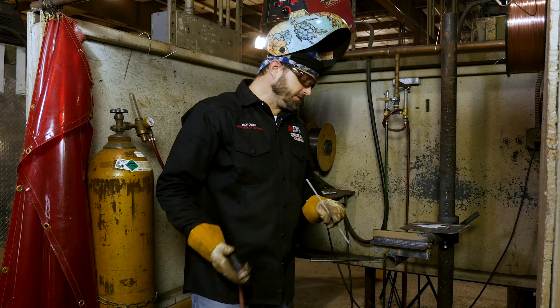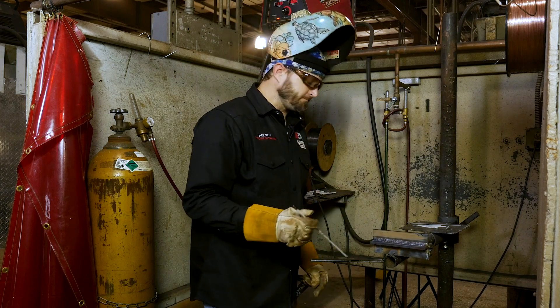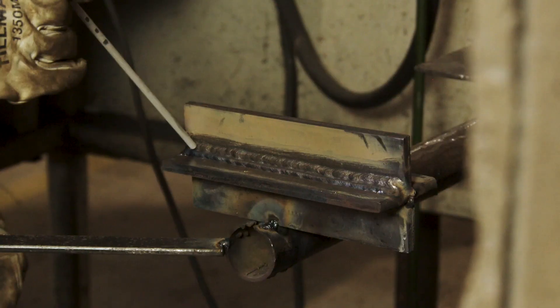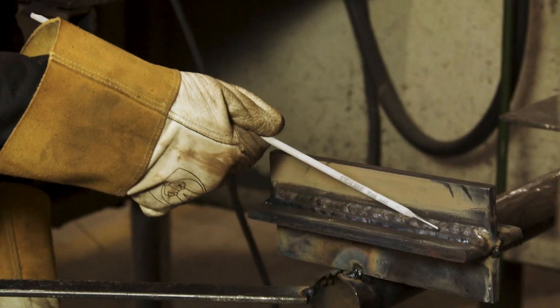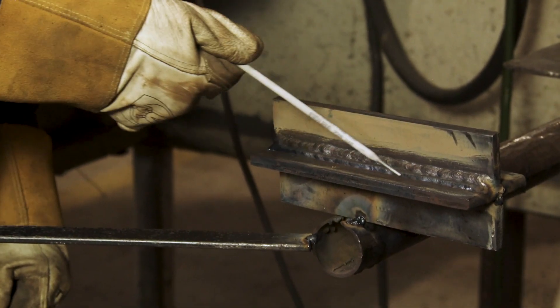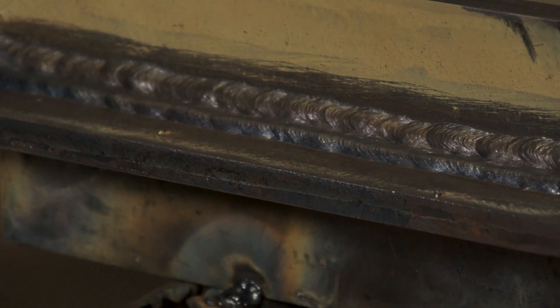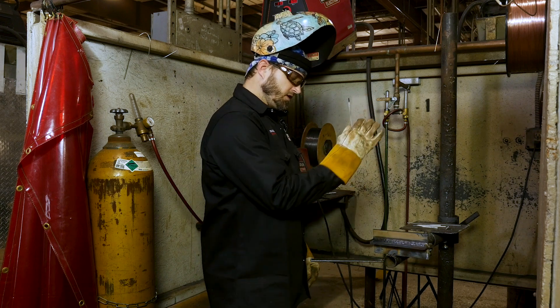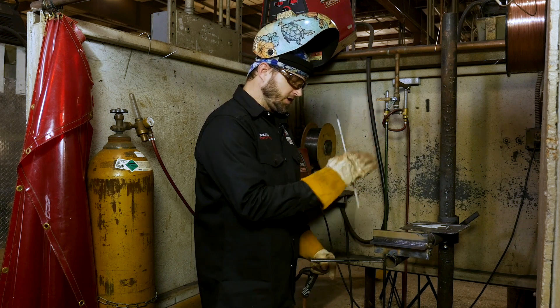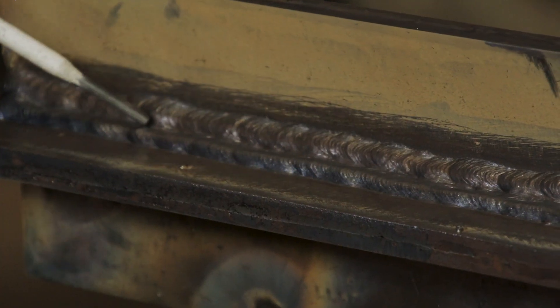So we've got four in there, and now five. When you run bead five, it's pretty much just like how you ran bead one — something like a 45 degree angle. What we're trying to do is put it right in this little valley right here. We're trying to lay our bead in there and make a nice ramp — a nice smooth 45 degree slope with the correct even leg lengths. We're going to fill this piece in right here with bead number five going right in the middle.